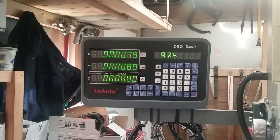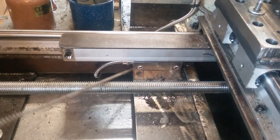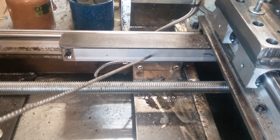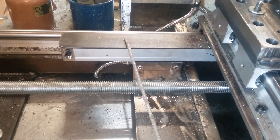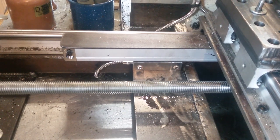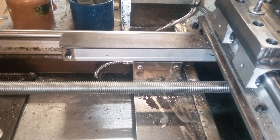So let me show you how I did the rails and the slides and the mounting on this. Down in there, that is the x-axis. There's the reader, and there's the rail. I mounted the readers underneath the rail to keep the crud out of them. This is just a piece of angle iron. The covers and the brackets that they included in the kit were not really something I could make much use out of, so I just made my own bracketry. I mean, I built this silly thing, so why wouldn't I make my own brackets? As you can see, the rail moves and the reader is stationary in my setup.